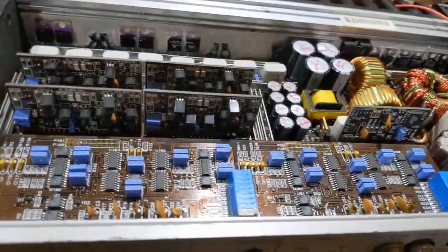There are some common problems that occur on these driver cards anyway. These are known for developing cracks on the surface-mount resistors. And down towards the bottom where the pins are, there are some 10-ohm resistors that tend to go bad or develop intermittent shorts. So we'll get this card out of here and look at it and get it worked on.